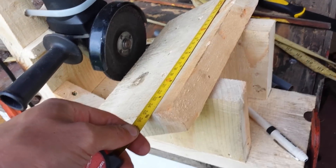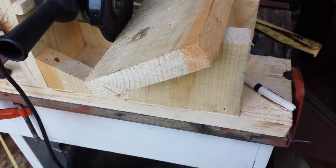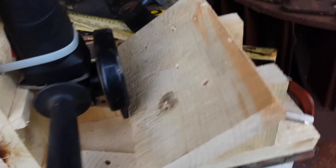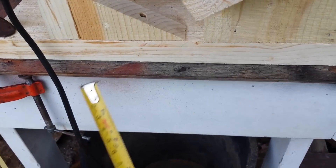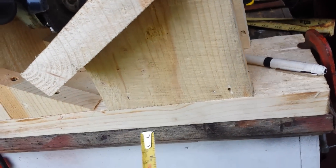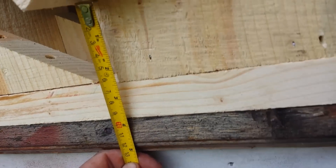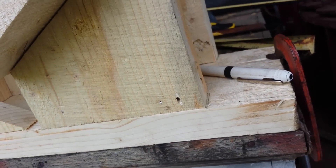The top piece is about 10 inches. The two sides are 6 inches — so there's two of those pieces. One is 10 inches and then 6 inches wide. This one here is also 6 inches wide and it is 15 inches tall. The angle brackets — there are two of them. These pieces are actually the cutoffs from this board, so at the bottom it's about 2 and a half inches, a little less than 2 and a half, for the 30-degree angle.